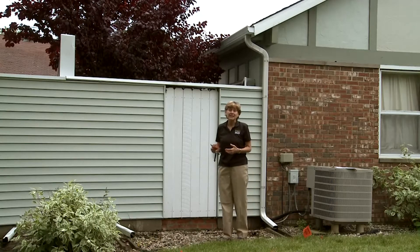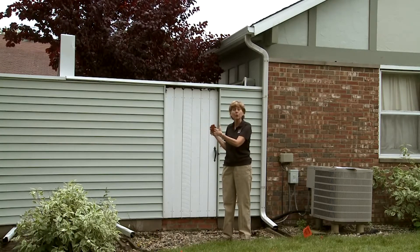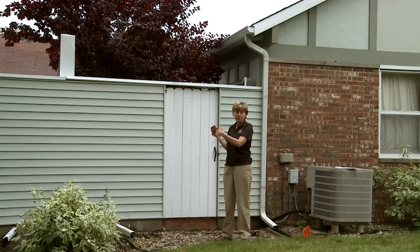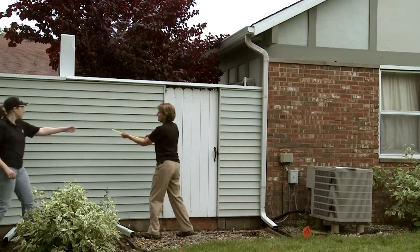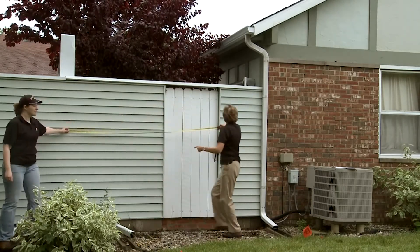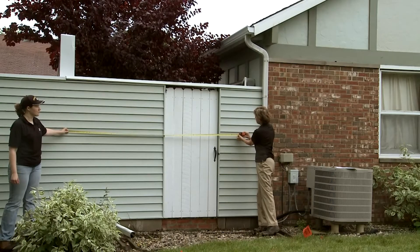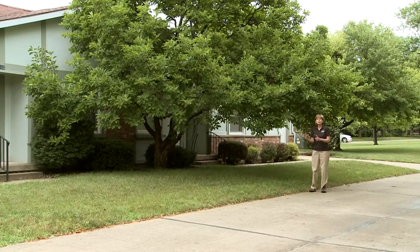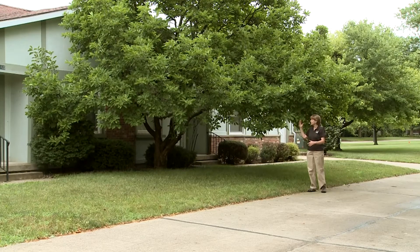This roof line is quite complex — it's actually a rectangle with a rectangle cutout, which is the patio, which was pervious so will not count into the rain garden calculation. So what we're doing is measuring the entire rectangle and then subtracting the rectangle that's the patio. We need to measure the size of the patio from the edge over to the edge of the roof line, which is where it stops capturing the water — and that would be eight feet, six inches.